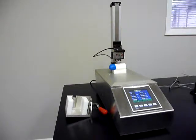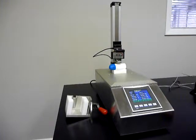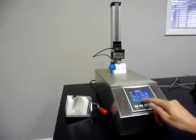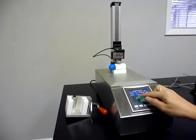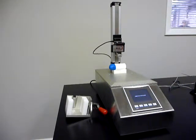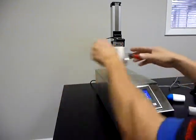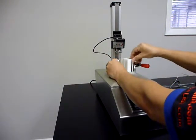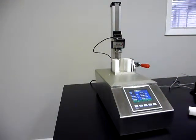the water flow test. I already set up closing force, opening force, and water flow tests, so by pressing the next and previous records you can go to test number 1 for closing force. Press the more button to home the carriage for the closing force test. Remove the previous change parts, put the new change part in, secure it, and this will be the closing force test.